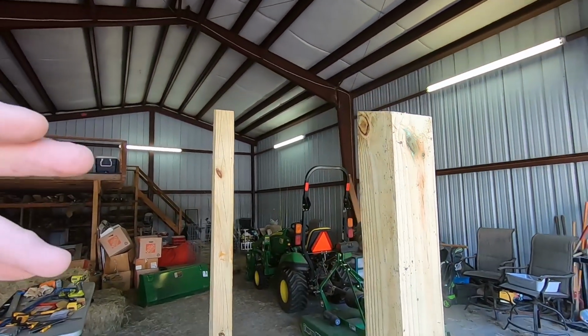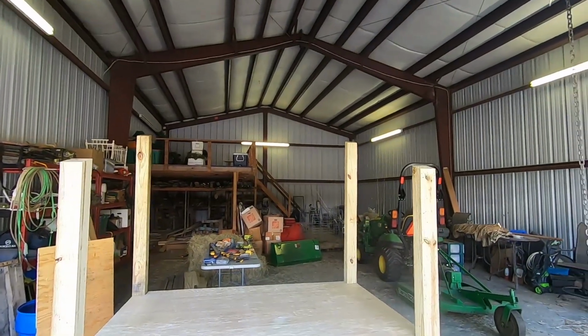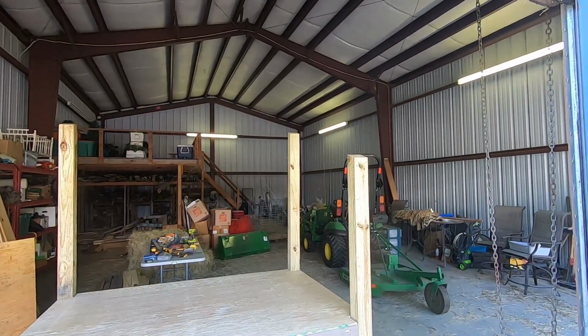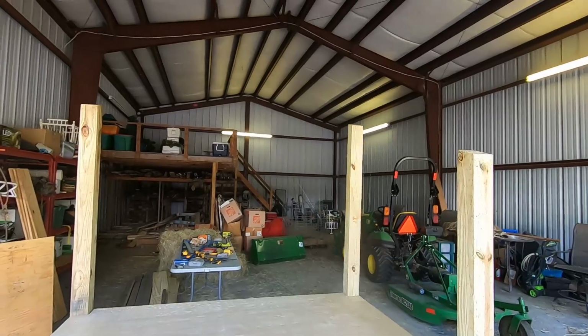But what I don't like about doing that is the rafter itself doesn't have as much board to sit on. If you do that, it's sitting on the very corner of that. Now you can notch out your rafters, which also works, but still you're only getting maybe half of a board's width. I'd rather have a full board's width, and since I have a table saw, I can go ahead and rip this down, no problem. But if you don't want to do it with a skill saw, then simply get the hurricane clips and attach them. I'm going to attach these anyway, but I'm going to have a full board for them to sit on, plus the hurricane clips to hold it, because obviously here in Florida, we get hurricanes, and I want to make sure this roof does not come off.